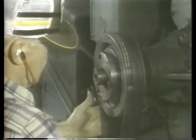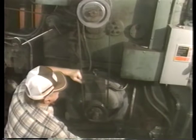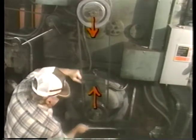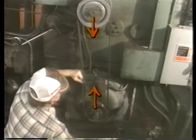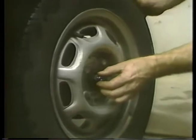Improper adjustment of machinery can also overload bearings. This belt needs to be under some tension to transfer its power without slipping, but it should not be tightened any more than the manufacturer's specifications. The higher the belt tension, the more load on the bearing. In other cases, improper adjustment of the bearings themselves can cause overloading.